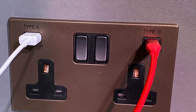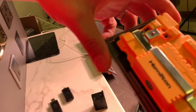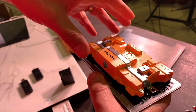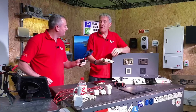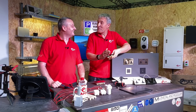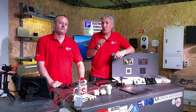Nowadays everybody wants faster charging. There is a limit to what you can ask a 13-amp socket to do, because faster charging needs more power in a shorter period of time. Looking at the back of the socket, you can see that's where the charging module sits. If we want to put more power into this footprint, the socket would have to grow - and electricians don't want to be digging these into 47-millimetre deep back boxes everywhere. It's the real estate behind the socket outlet that's limiting the power. Perhaps in the future one of the 13-amp sockets might be removed to free up space. In the interim, Hamilton have launched a Euro module that will give us up to 45 watts of power.